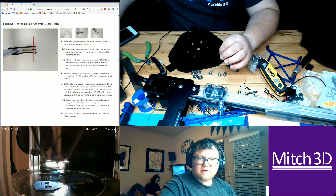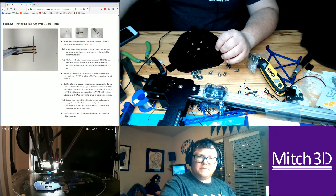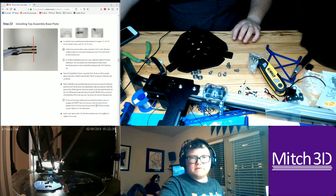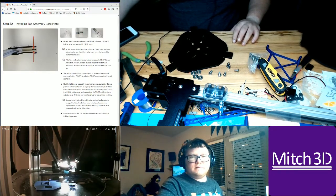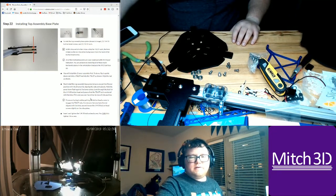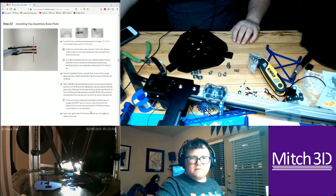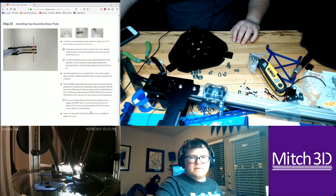Hold the panel flush against the tower plates. Look through the hole to check that the 1/4 20 bolt and T-slot nut are centered with the hole. If not, use your hex driver to move it into position. If you have trouble getting the button screws to engage the T-slot, first ensure that you have the nut aligned with the hole. Second, loosen the screws slightly on the side plates. Insert and tighten. You can fully tighten the screw.